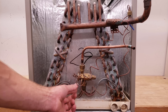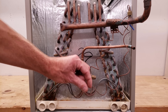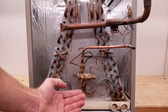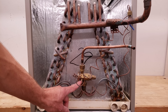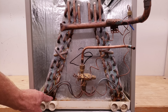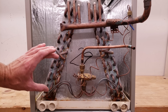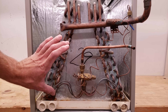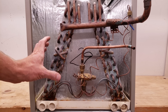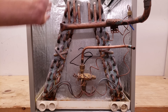What this is doing is limiting the amount of refrigerant — it's a pressure reduction device, allowing the expansion of the refrigerant to occur. As low pressure liquid exits the thermostatic expansion valve, it enters the coil as 80% liquid and 20% flash gas. The refrigerant is saturated and can absorb heat from the air crossing over the coil, which lowers the air temperature.